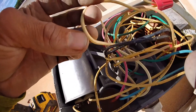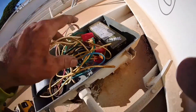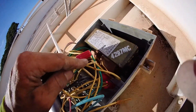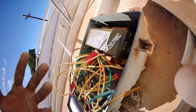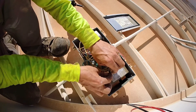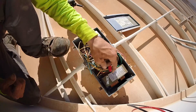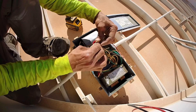We are off. It's not physically hot to the touch. This transformer or ballast sure is something. Let's look for any other compromised pieces — this is that cloth insulation. All it takes is to bend it back and forth a little bit and you've got exposed copper — that's what old-school wiring looks like. It looks like the insulation is squished so badly it was on the verge of arcing right to the metal of the transformer. I'm going to tape this weak spot up, then power back up and check the voltage.